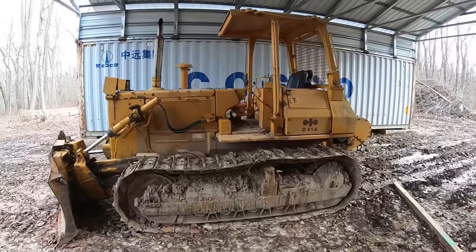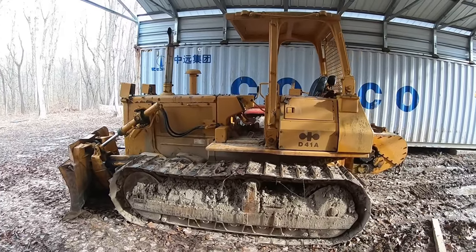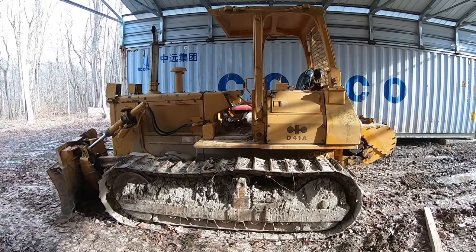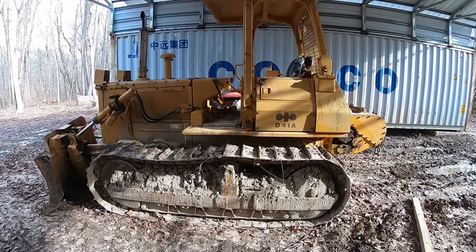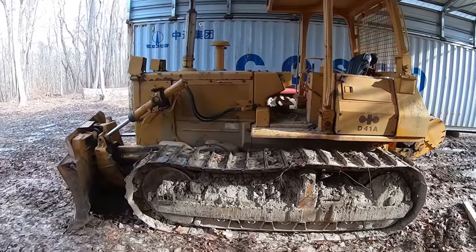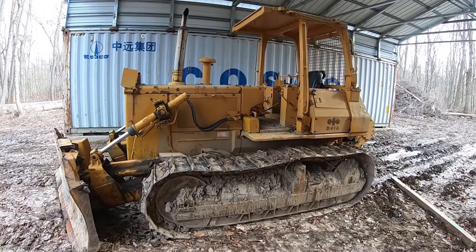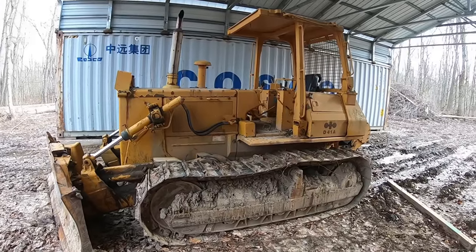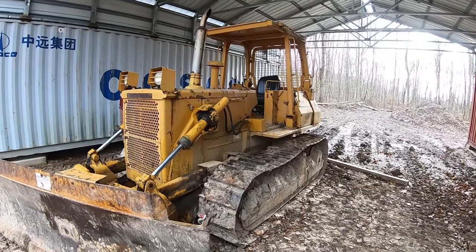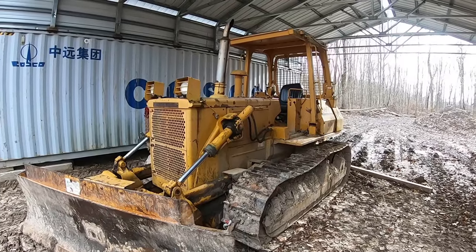If you're not familiar with the Autocar, go back to my channel — I'll put the link down below in the description. Go back and watch the intro video of me getting this truck and bringing it here to the farm. What we're going to do today is try to get it started, and if we're not successful, the dozer will drag it back here. The Autocar has been sitting since 2004 — that's when the guy I bought it from parked it. He didn't try to get it started, just put it on a lowboy and sent it here. We're going to use the 24-volt starting system on my dozer to hopefully jump-start the Autocar.